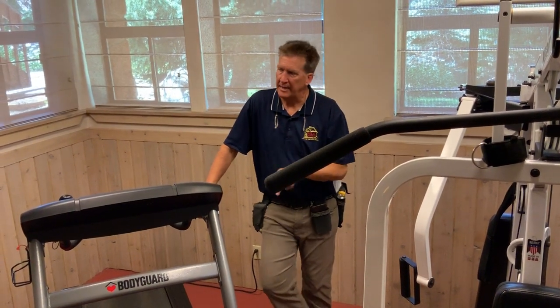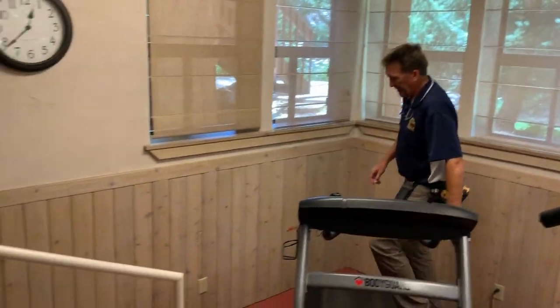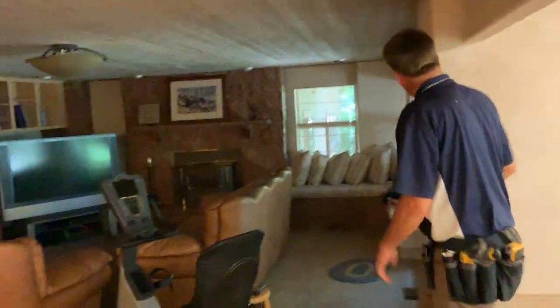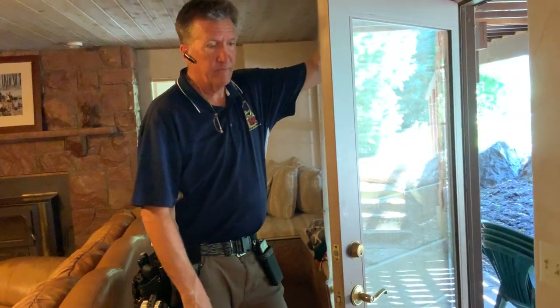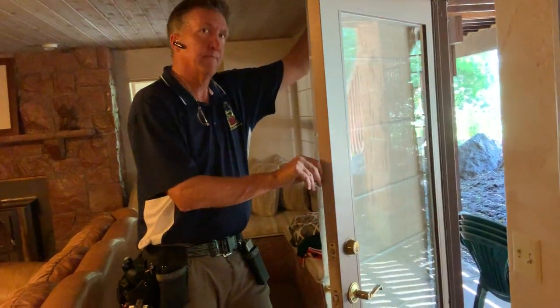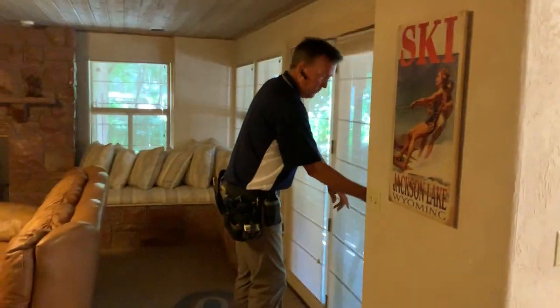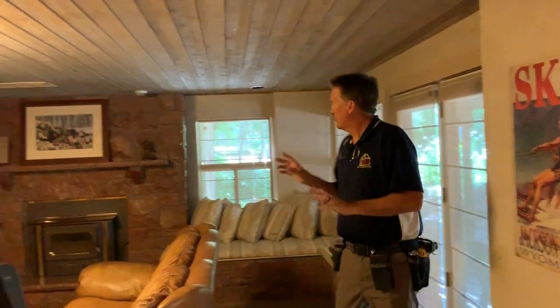This is most likely what's over here by your rear door as well. Now, do you want to pull the carpet up and shave this down so this door swings? Or like we talked about on the outside, raise this door, pull the door out, reinstall the whole door up an inch or so, give you the clearance. Raise the bridge, lower the river, probably. Yeah, raising it would be. I showed you the water entry there. We talked about that. Got that. That's off.